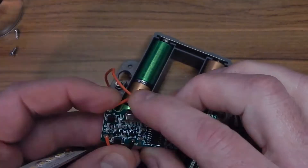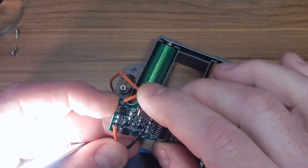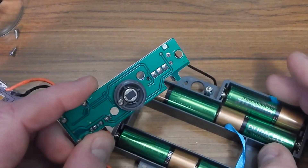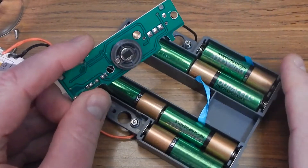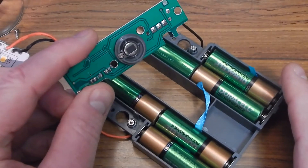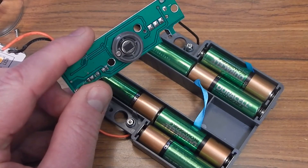You've got your dimming, and you have off in the middle, auto which means it goes through the PIR and timer, and then just on all the time. So for 24 bucks it's well made and works properly the way it should. You're going to get long run times with these kinds of batteries. Something like this with intermittent use could last you many many months — you can get a year out of it, or easily six months, depending on your dimming and run time. When it's in standby PIR mode it's virtually using nothing from the batteries — it's basically just the shelf life of the batteries.